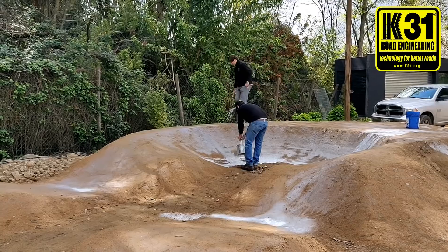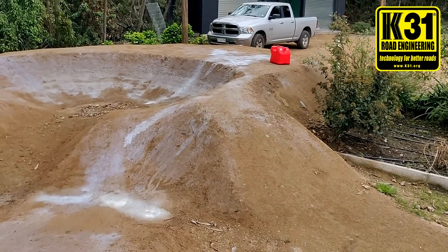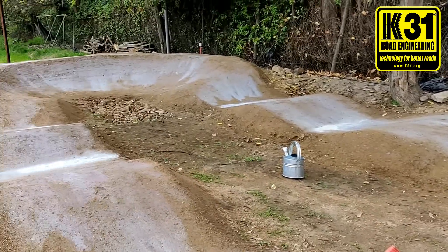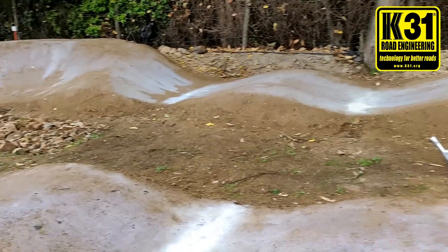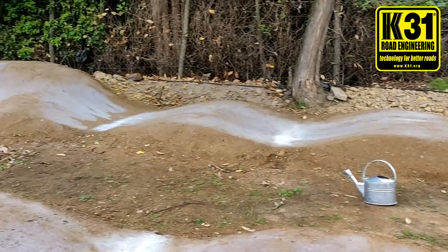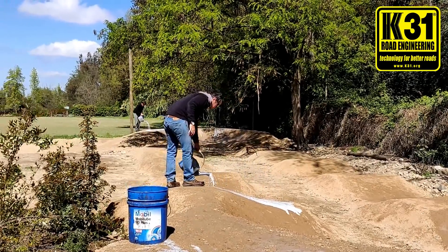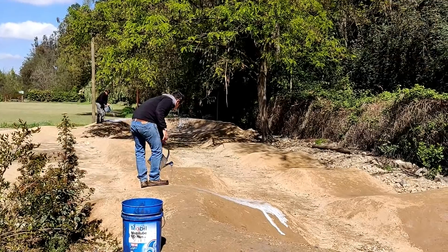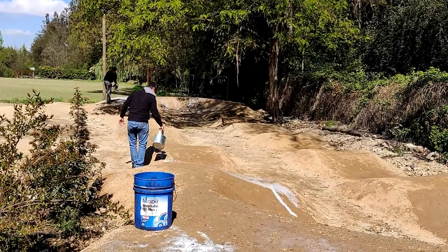You want to cover every space that you can and cover all the soil. The first coat will be absorbed a lot faster, going into the soil about an inch, maybe two inches. Then the top coat will basically seal off all the small crevices on top. We have some extra mixed APS already so we just pour it in — this will make it waterproof and protect against dust and erosion of the soil.